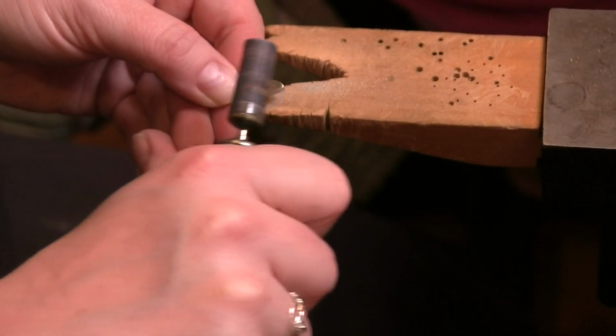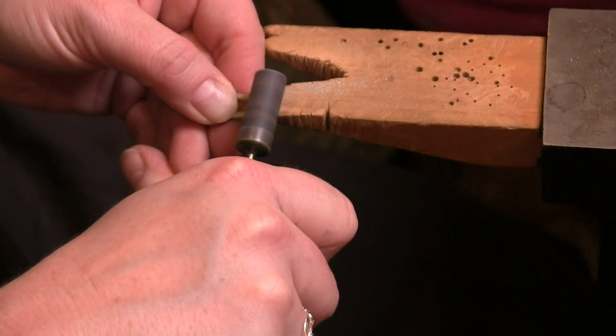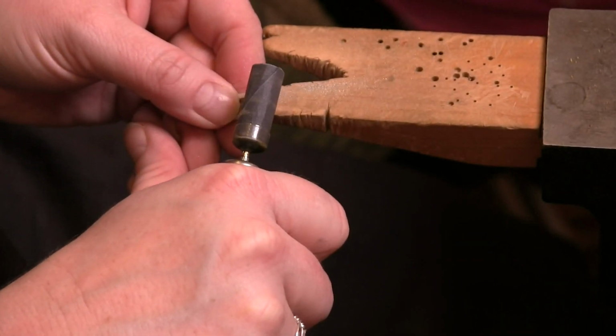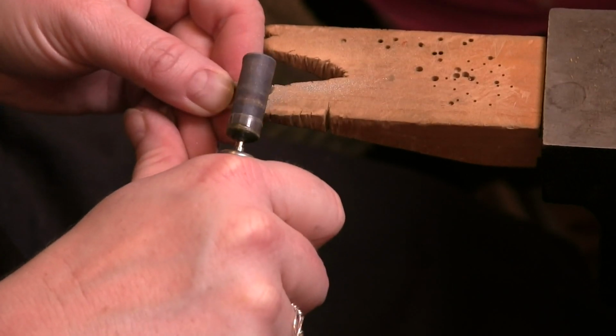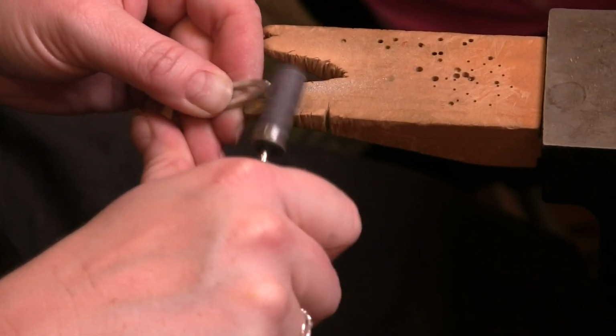So now I'm going to support by placing my thumb here, and that way now I can just come in and out like this, right? So placing this down. Now here's the thing too. You can hear if my piece is up against my bench block, or my bench pin. So you hear that? Listen. Like music. Hear the difference?